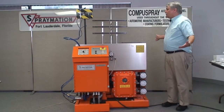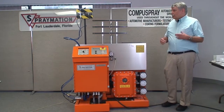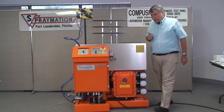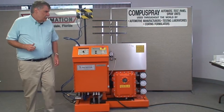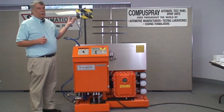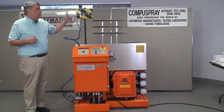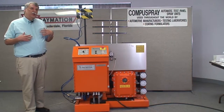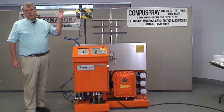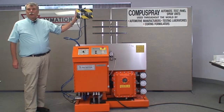This particular machine is located in a large open area. Some spray labs have that, but many spray labs put a machine like this in a four-foot wide spray booth. If this machine were in a four-foot wide spray booth, the wall of the booth would be approximately where my arm is, and there are only a few inches between the side of the gun mounting assembly and the wall of the spray booth. For those installations, there is a crushing hazard between the wall of the spray booth and the mounting bars for the spray guns.